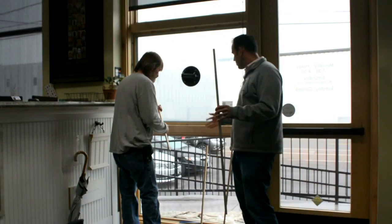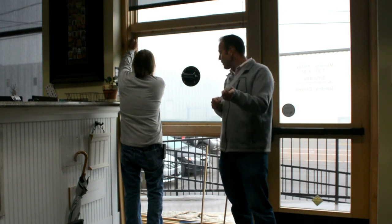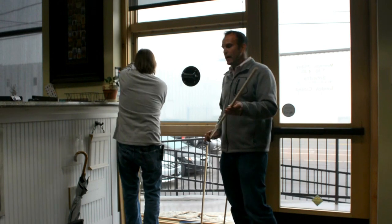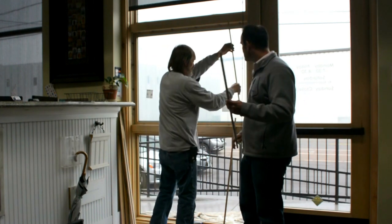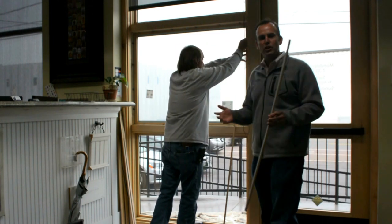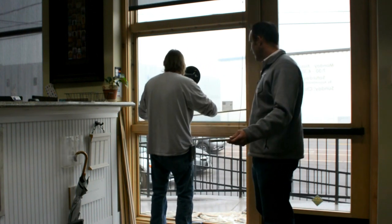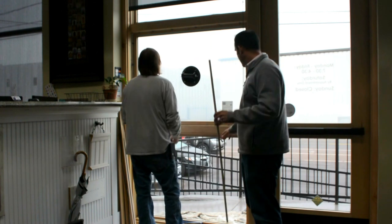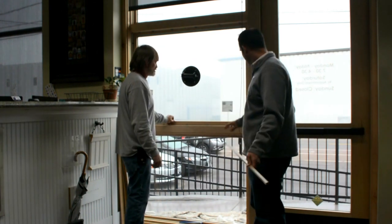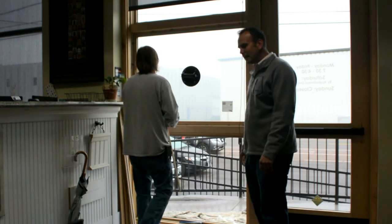Randy is a true professional and he knows how to properly remove these pin nails. We're going to use all four of these glazing stops — this is the stop that holds the glass in, the glazing stop. Since he was able to get all four off without damaging them, we're going to go ahead and use the existing ones. The reason is that this clear maple, being right next to the sun, will fade and change a little bit. If we had broken one piece, we would have put all four new ones on, but since we didn't break any, we're reusing the old ones. He did get the new glazing tape put on there — we took off the old, cleaned it up, put new glazing tape on. This has a beveled edge so any water will roll off. These are our contemporary stops and the last piece goes on — the glass is now glazed in.